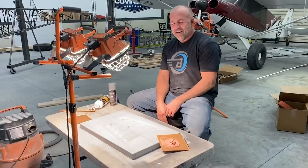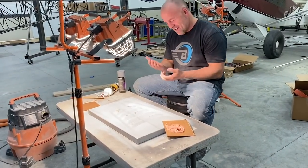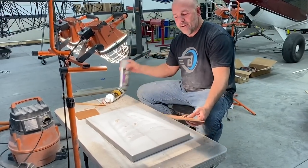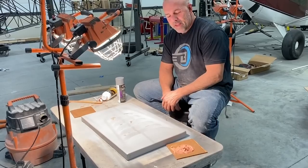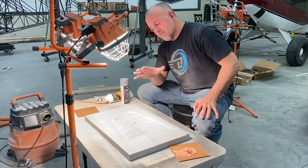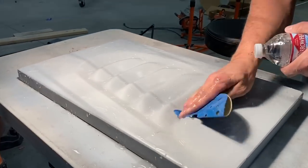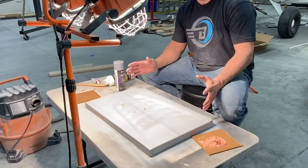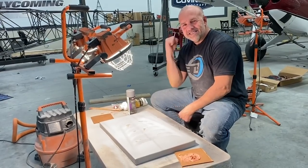3:28 a.m. All right, guys, this silly little part is taking forever. I'm going to keep going until it's done, even if the sun comes out. So I'm now putting on layers of filler primer down to the final steps, using little dabs of a flowable Bondo putty, and I'm touching up the last little bit. Then I'll add some more, then I'll wet sand. If it's good, we'll go with it. If not, I'm going to wait, do a couple more layers of paint and go through it again. But it has been a tiny part that has taken, I don't even want to tell you how many hours, way too long. So we're just going to keep going until it's done. So, back to work.